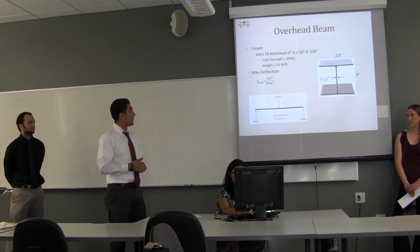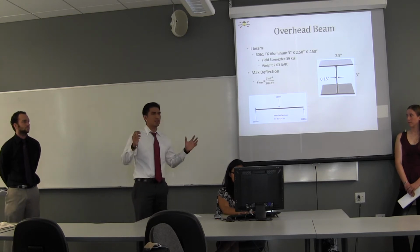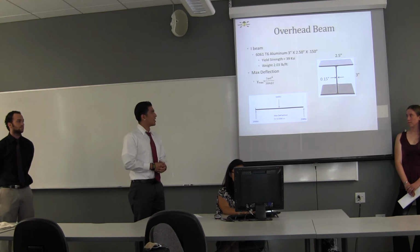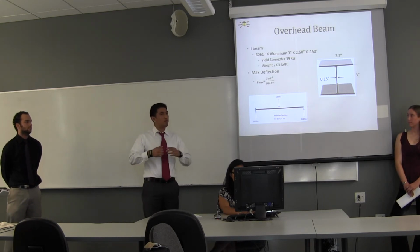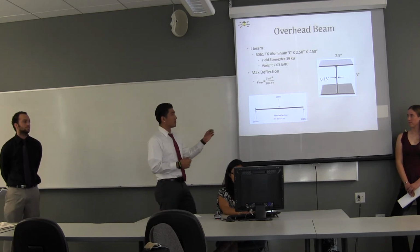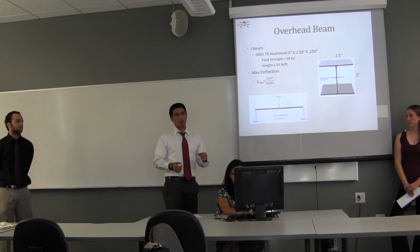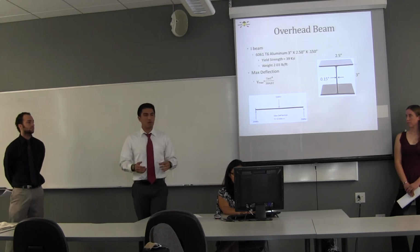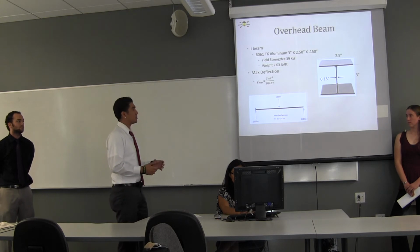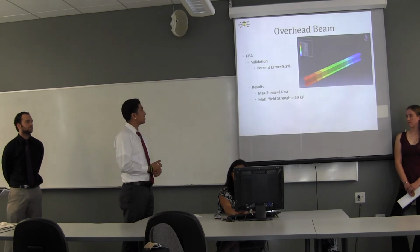Initially, what we did was simple calculation back to CE 204 days, and we did a maximum deflection. We were able to get a value of 0.14 inches, and that's maximum deflection right in the middle with a load of 500 pounds. So that's not a lot, and that's a good thing, but we're not really interested in how much it can deflect as much as we are in the stresses. So if you click next.